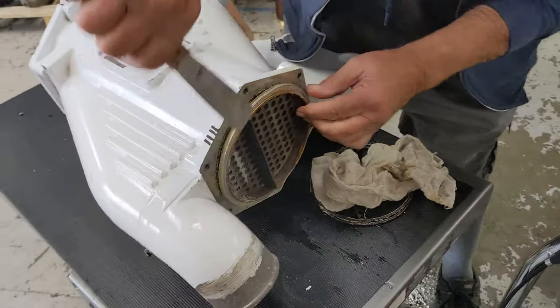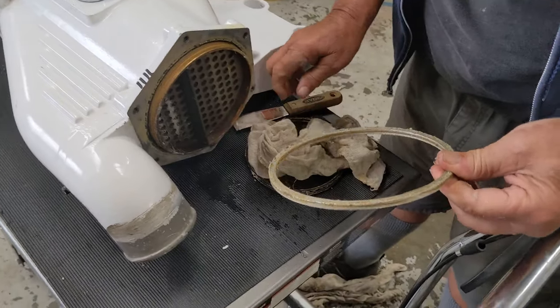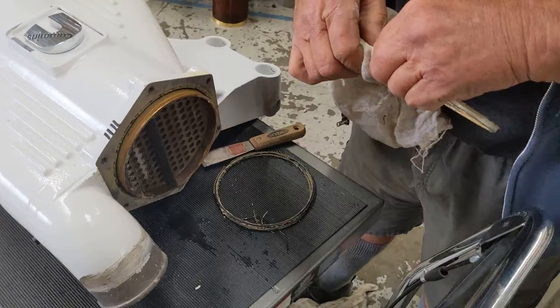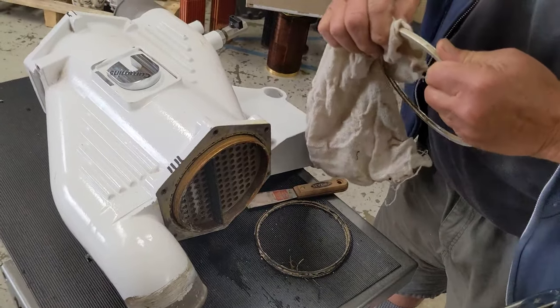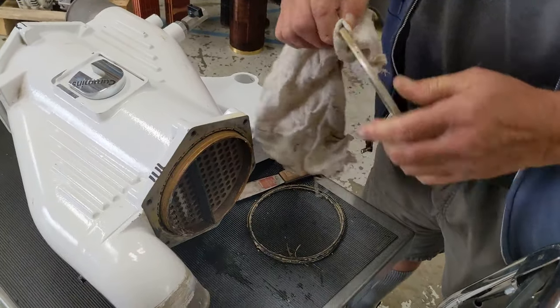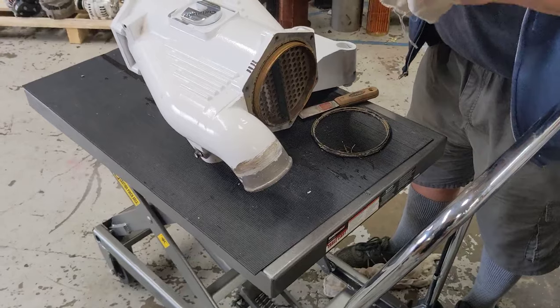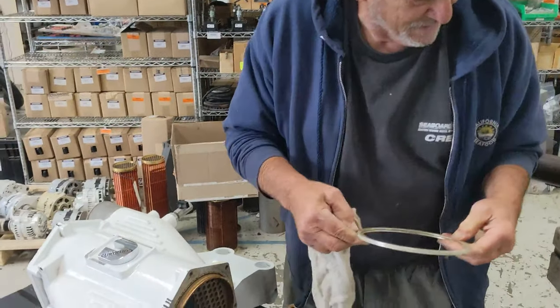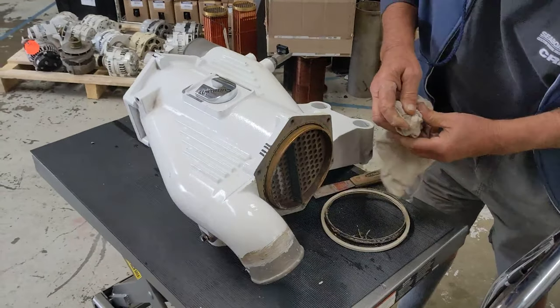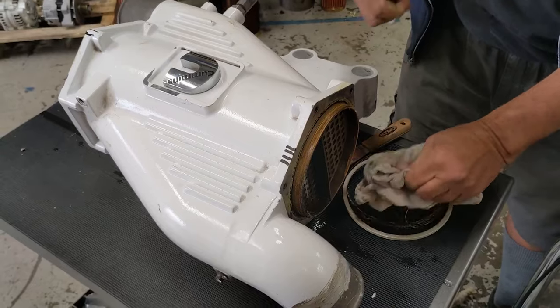Oh, popping it right off. And it's aluminum too, but that's the beauty of grease. If you leave this thing together dry, it will come off in pieces. Grease and fresh water, that's the key. Aluminum and brass do not get along. That's the Alco Metal Lube, and it's done a wonderful job. So now this thing should pop out that way, in theory.